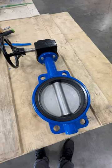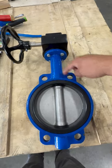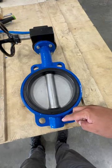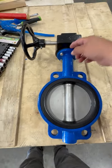Here we have a butterfly valve — it's going to be a wafer style and it's going to have alignment holes, two on top and two on bottom. This is going to be a single shaft with long stems, gear operated here on top.